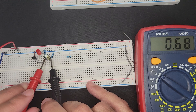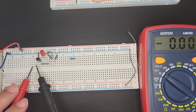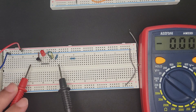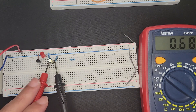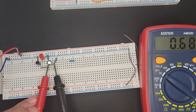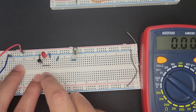We're at 0.68 volts. What seems to be happening right now is the power going from the collector is going out of the emitter, ignoring the LED. This means that the base is on right now — it's energized. So if this capacitor only reached 0.68 volts, it seems to me that as it charged up, the LED was on because the base was not activated, and we had to reach 0.6 volts for the base to turn on. So what we've kind of made here is a delayed turnoff circuit. It seems the LED is going to be on by default because the base is not on by default.